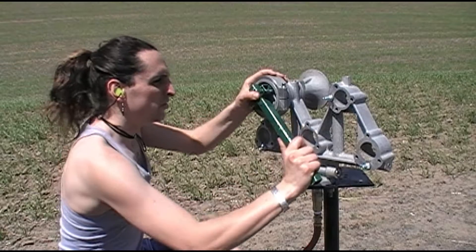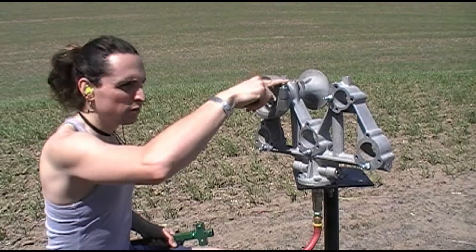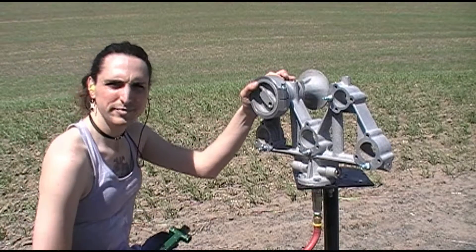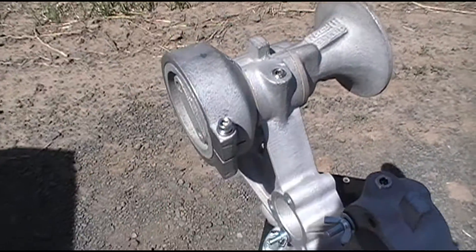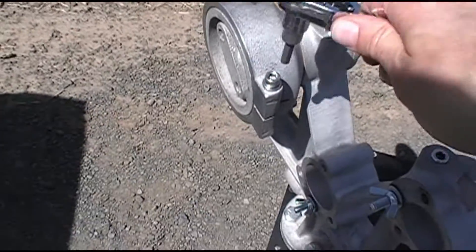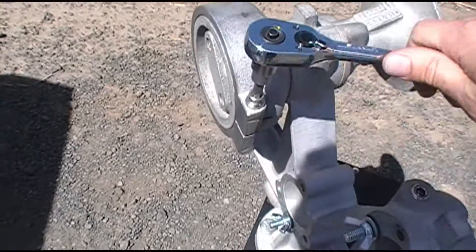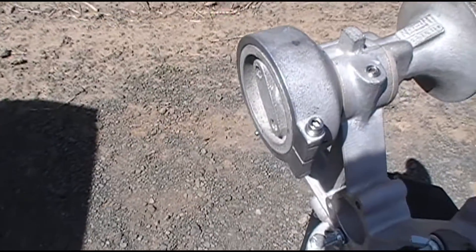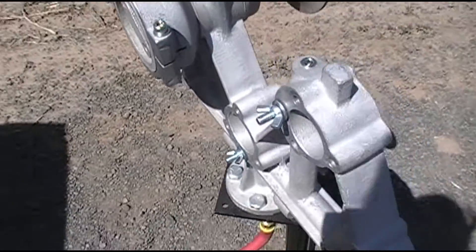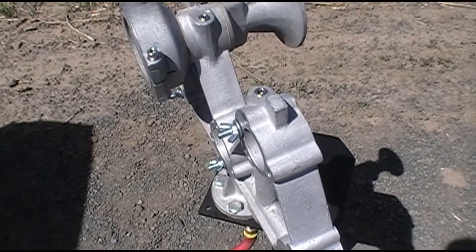Common wisdom says tighten it just a little bit more past that solid note, and then tighten your clamp ring screw down. Now that we've got our number five bell properly voiced, just tighten down the clamp ring. This does not need to be super, super tight — just enough to have it firm so that the cap is not going to back up on us.